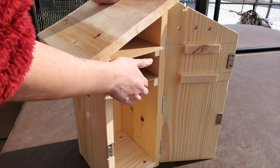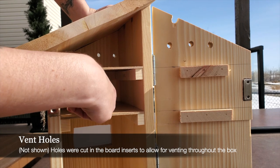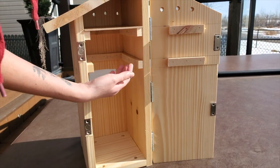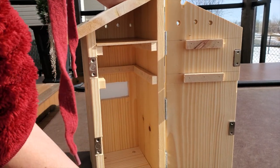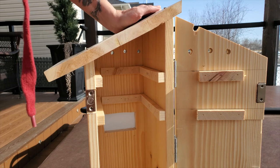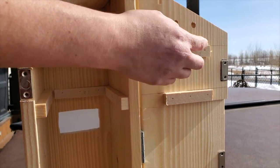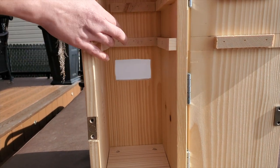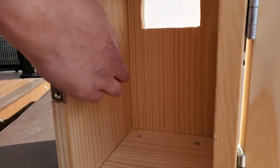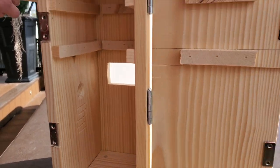This is the inside of our nest box. Up here is where the camera is going to go — it's going to hang from this board, and I'm going to cut a hole in the bottom board for the camera to see through. This board is there simply so I don't want any birds flying up into this area and getting caught near the camera, so this guard keeps our birds nice and safe. These boards are rested in place using these half-inch pieces of wood — we just glued those down and Brad-nailed them all the way around. And by the door here we've grooved in with our circular saw some little edges — it's a little ladder that helps the chicks and birds grab on to get out of the box, which is a nice feature to add to any nest box.